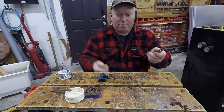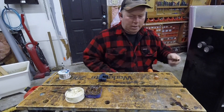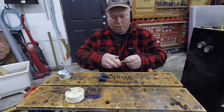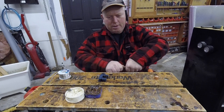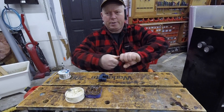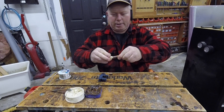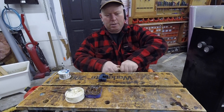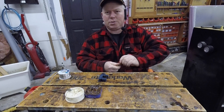So that one's cut. After you cut it, you need to prepare the copper so it will take solder. You have to take the oxidization off of the copper. You can use sandpaper or steel wool — steel wool is quite good. See the difference? How shiny that is? You've got to make it shiny again, otherwise the solder won't stick to it.